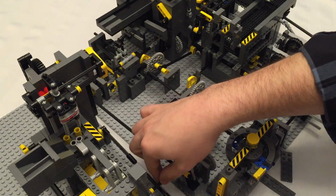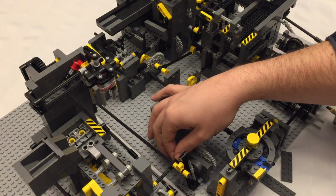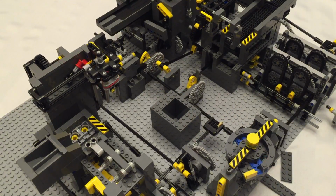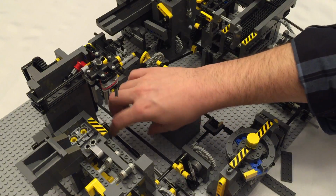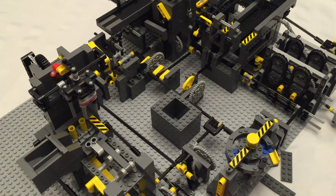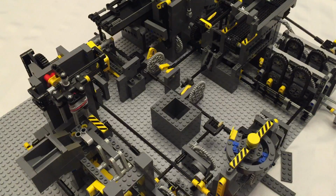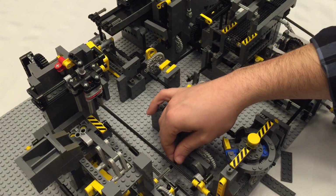We'll slide the board apart, and turning this axle counterclockwise, we will also get our ball loader to the center, and we'll reconnect it to the system. And let's have a look how that runs. Everybody pulls away from center. The ball loader's a little bit delayed, so we want to advance it just a little bit. We'll go a quarter turn there. Still a little bit. We'll do a quarter turn more. That's pretty darn close. I'm going to try just one more quarter.